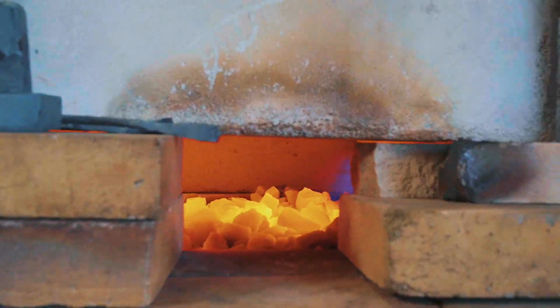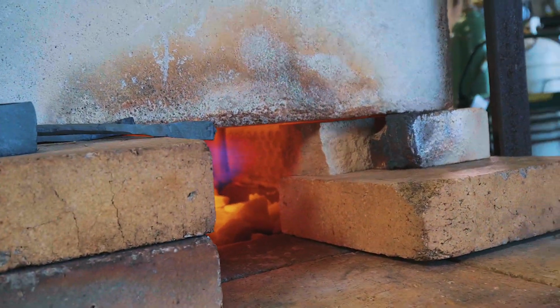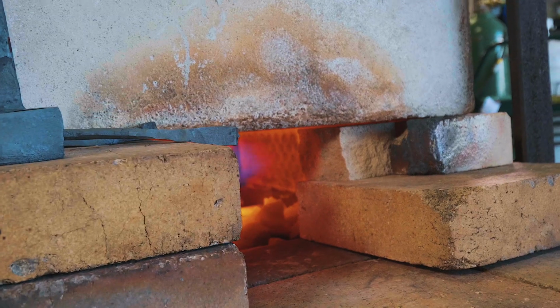Okay, it's been going about 20 minutes and I think it's about enough time for me to be pretty certain this isn't gonna be getting a whole lot hotter. What's strange is that even after it got hot, that flame is still only coming out of a third of that ribbon burner. So I don't know if maybe there's an issue with the ribbon burner now. Maybe, from heating and cooling, the refractory has cracked. I have no idea. It didn't seem like that should be an issue with the blower, but big forge, still not working like it should.